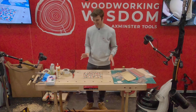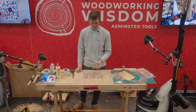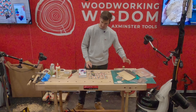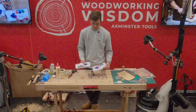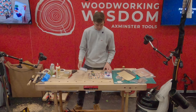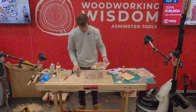This is the most fun part. You can fill the gaps with wood filler, resin, or epoxy. The simplest way I've found is using two-part Gorilla epoxy, which you can get from any home centre, and then you pigment it. You can pigment it with graphite powder to make it black, or even food colouring — just anything to change the colour. The best method I've found is mica powder from a company called Mosu on Amazon. It's pretty cheap and comes in so many colours — red, blue, black. I like black; I think it looks really nice. But the most common colour is white. I'll go for black today.